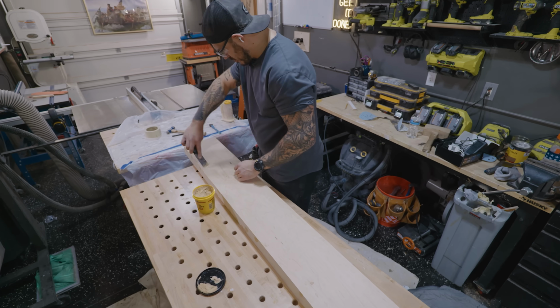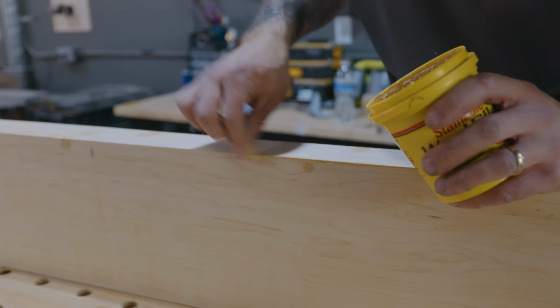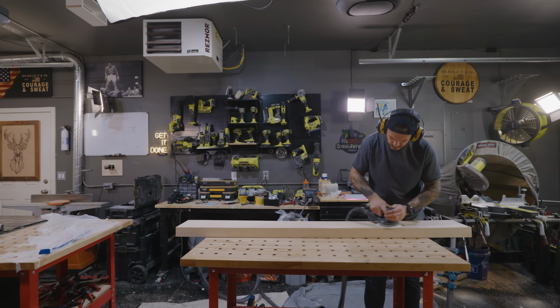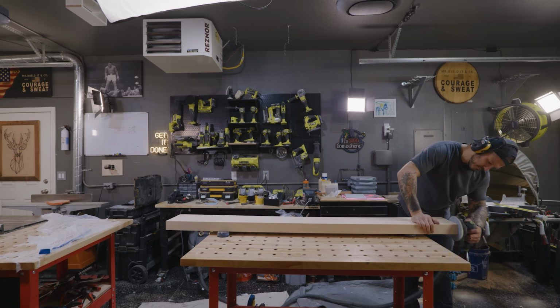The wood filler is dry on the advanced shelf, including all the crevices where it wasn't so tight. I'm going to start sanding it with not 80 grit, but only 120 and then 220. I don't want to sand too much of the maple plywood veneer off, so that's a thing to be cautious about.